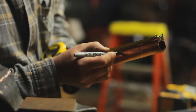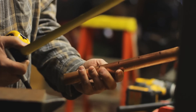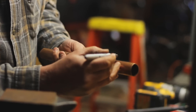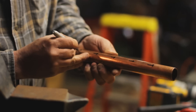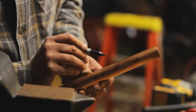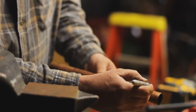You'll have a row of marks there. Then rotate the pipe 90 degrees and put marks in between those — they'll also be two inches apart. Then that's where we're gonna drill holes all the way through the pipe.